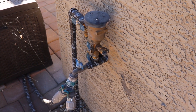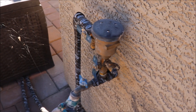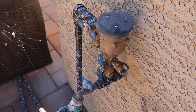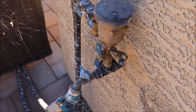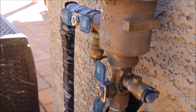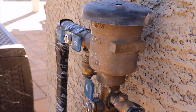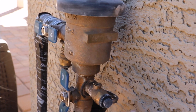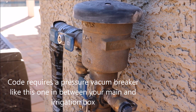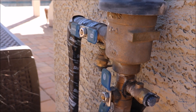There are going to be different configurations you can choose for your sprinkler system, but in general you should have something like what you see in front of me — this is a backflow preventer. This is what I use between my main water line coming out of the wall. Here's a tee that feeds a hose bib, and this is a pressure vacuum breaker — an intermediate component needed to prevent contaminated water from backflowing into your house. These are actually required by code, so if you're going to install an irrigation system yourself or have a plumber do it, definitely ensure this is installed.